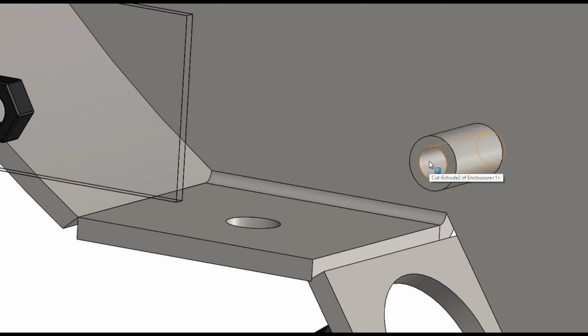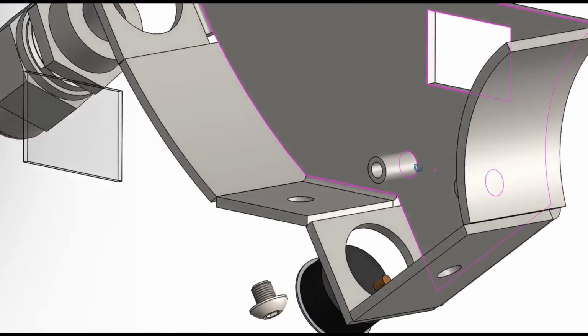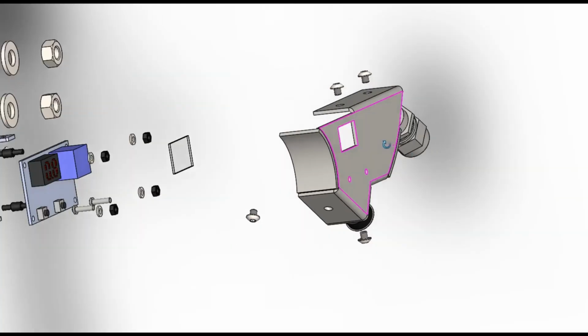So it's about a 3 mil inside tube and 5 mil outside. And they are tacked in 3 places, or 3 or 4 places. Tacked as little as possible to keep you from distorting this face because it's polished to a mirror.